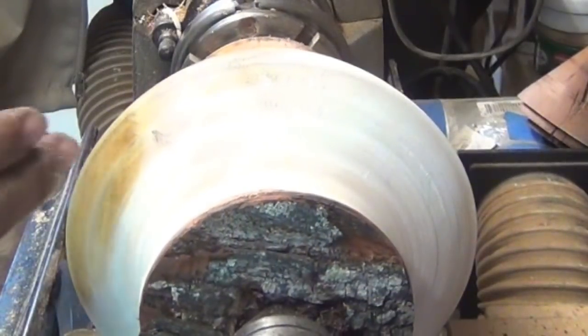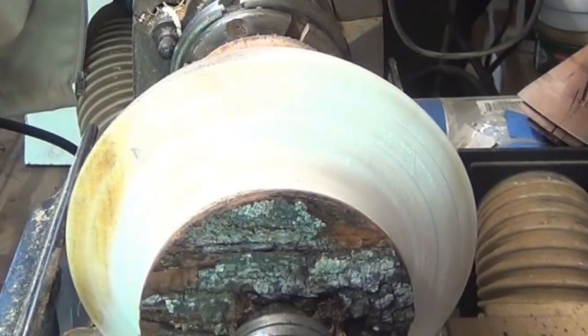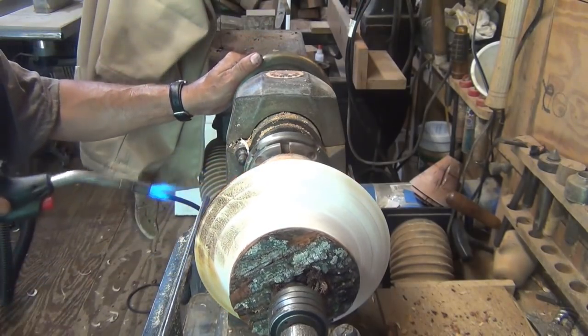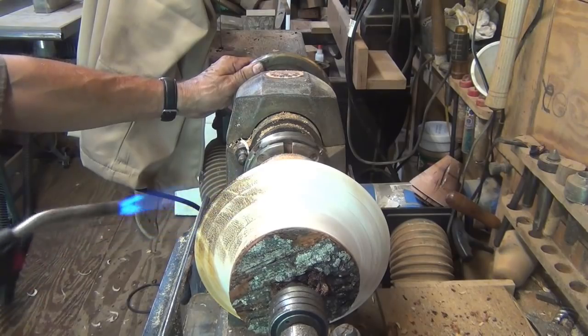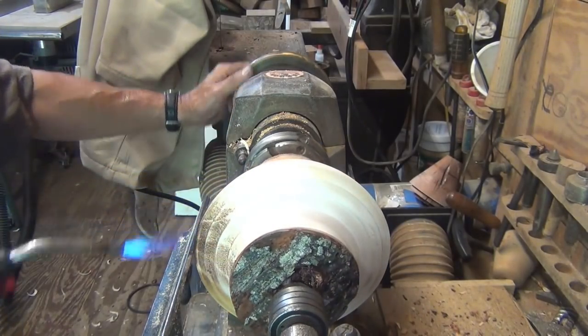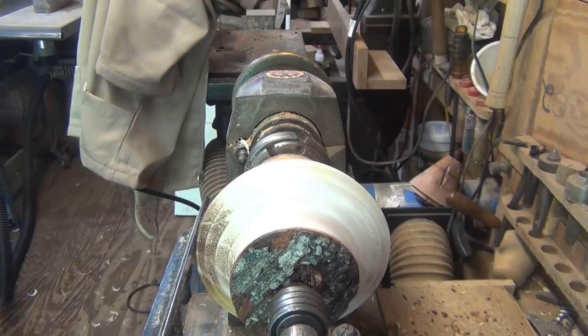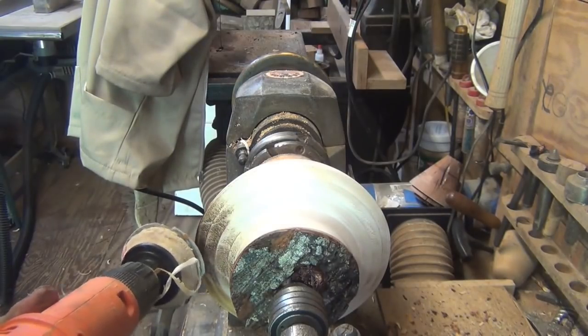Torn up grain at this point, I probably could sand it, and if you have a hard time sanding wood grain, one of the things that I suggest, of course, you can do water, you can apply a sanding seal and it will stiffen up those fibers, but one thing that I find that works pretty well is if you lightly torch that area, and you basically are burning up just those fibers, nothing else. So anything that's raised up will torch and it will come off very easy with either sanding or re-scraping. So that's my trick that I can give you. That will give you a pretty decent clean cut. You're force drying it. So at this point, literally I could go in here and sand this out.